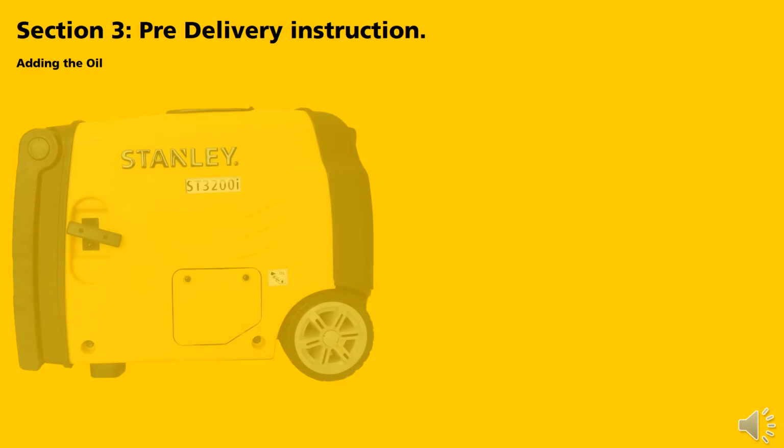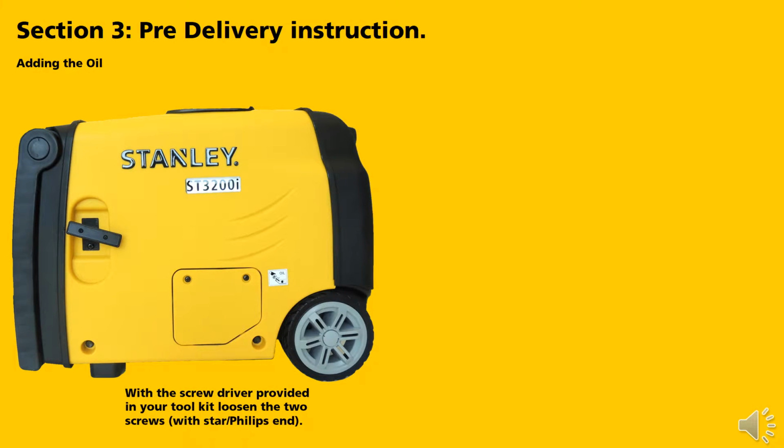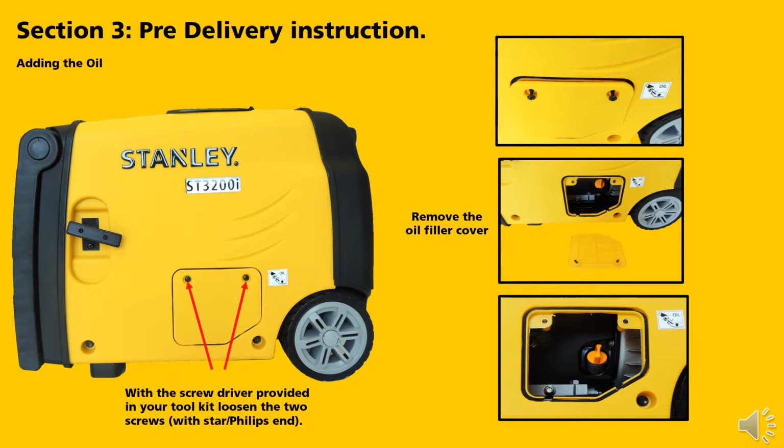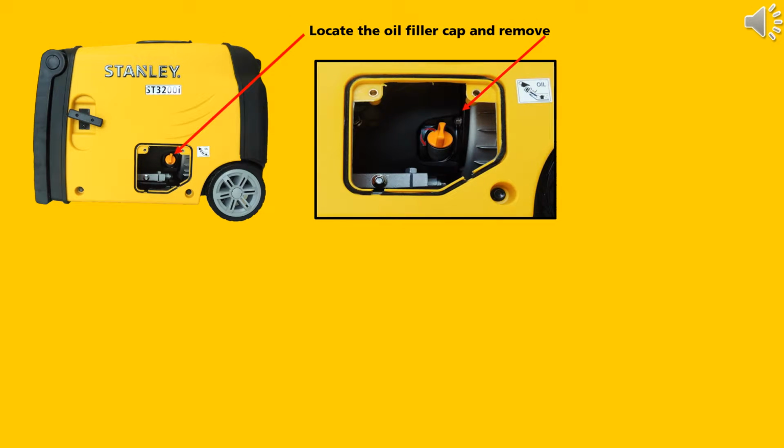Adding the oil. With the screwdriver provided in your toolkit, loosen the two screws as indicated. Remove the cover. Now that you've removed the cover, locate the oil filler cap and remove. Your ST3200i takes approximately 600 mils of SAE 10W30 oil.